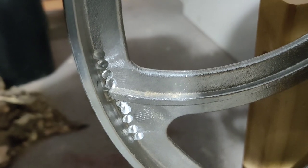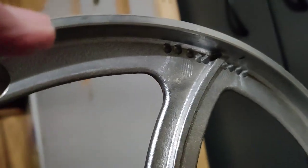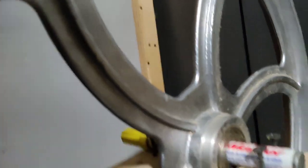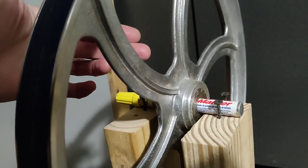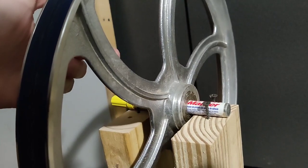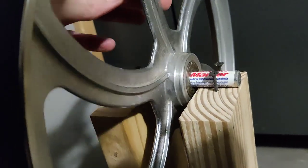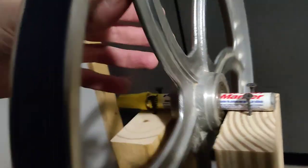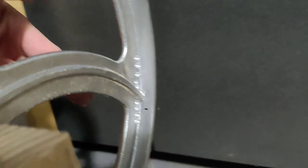If you let it go it's slowly going down, but not by much. If I put it up top now it almost stays. I'm going to say if I drill just one more hole at that same depth it'll be complete. The idea is to get to the point where anywhere you put it, if you slow it down it shouldn't go back — it should just stop. But right now you can watch it slowly creeping down, which means the weight on this side is still a little too heavy.